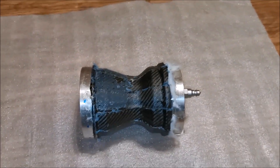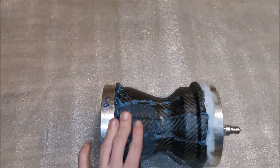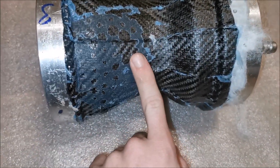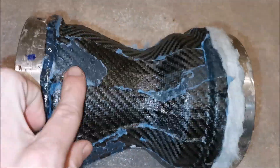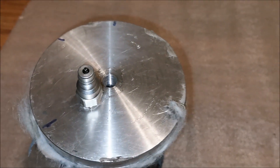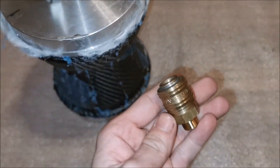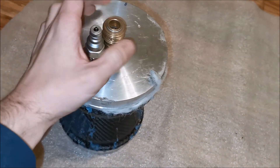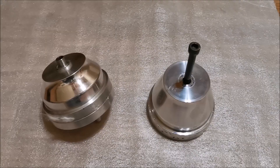Cooling is done and the part is pretty cool now. The next step is removing the part from the mold. I've already started removing the bag — the release film stuck onto the part a bit, which is unusual, but I don't think it'll be hard to rip off. Next I'm removing the bolt that holds the two halves together, then I'll put an air connector into that bolt hole and add compressed air to release the first half.